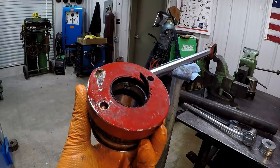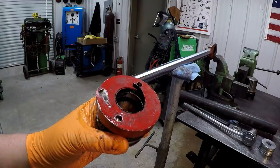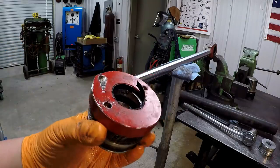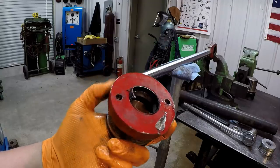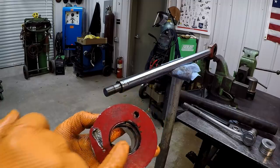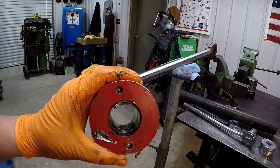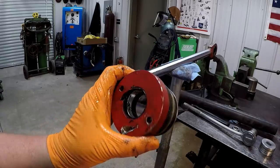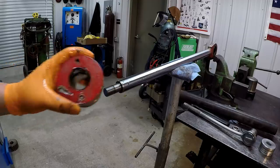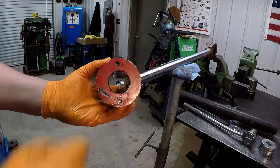All right, can you see inside there? The black ring in the middle there, that's your rod seal. There's an area of it that's completely missing. Deterioration. Probably age related failure, as well as the wiper. The wiper's gone too, just disintegrated. All right, so that's the problem right there. Usually whenever you have oil leaking through the rod gland here, the issue is the rod seal itself.